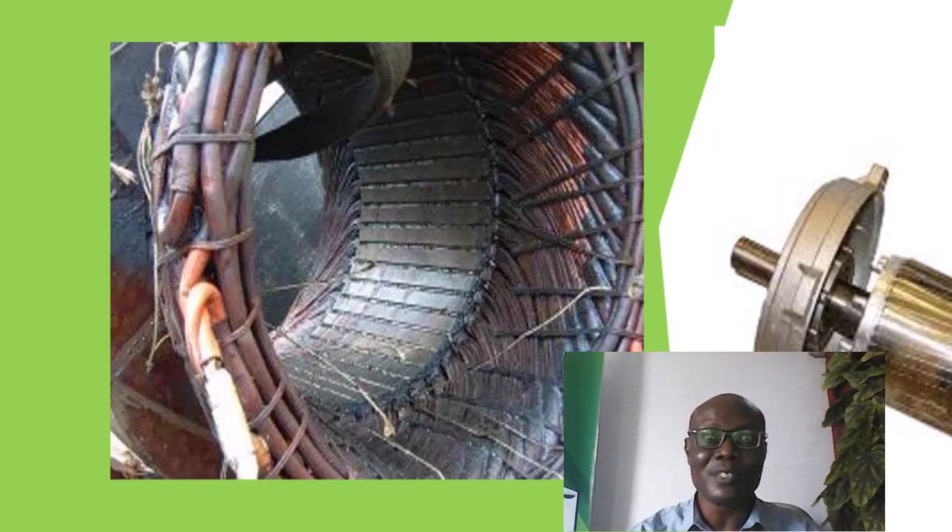They often make this mistake, and at the end of the day, after coupling, you see that the efficiency of the entire winding will go down. Then, as heavy current is flowing through this core, it is also generating heat that will further contribute to the overall heating of the equipment.